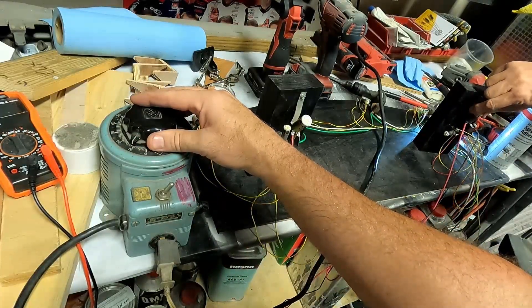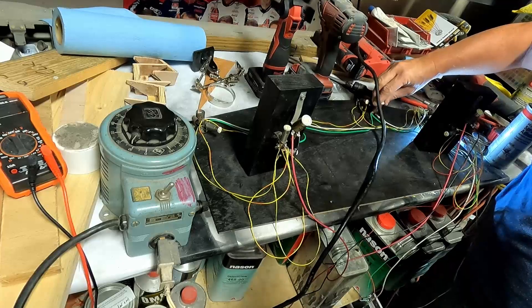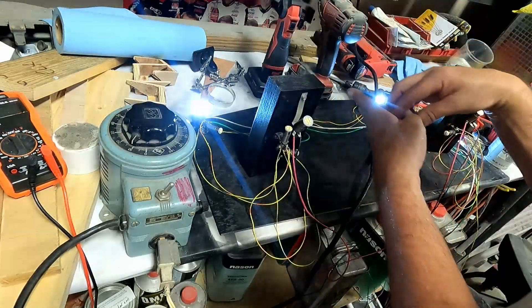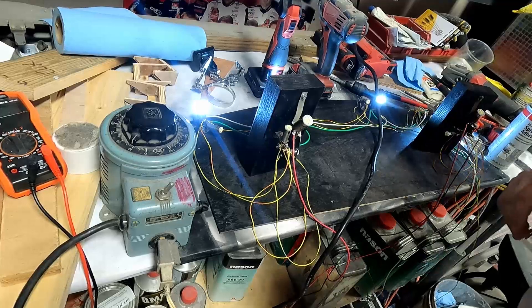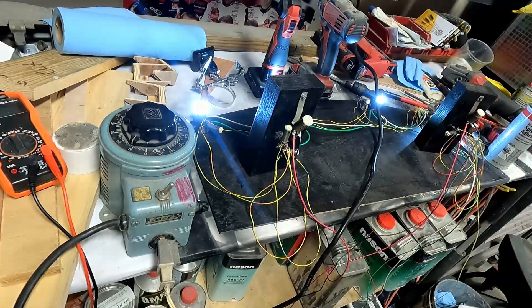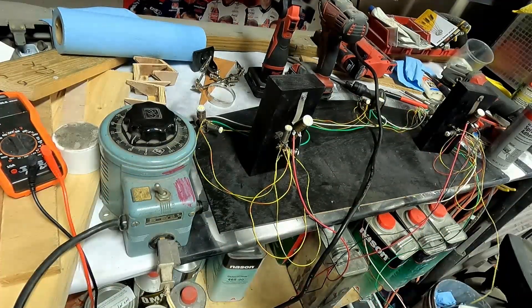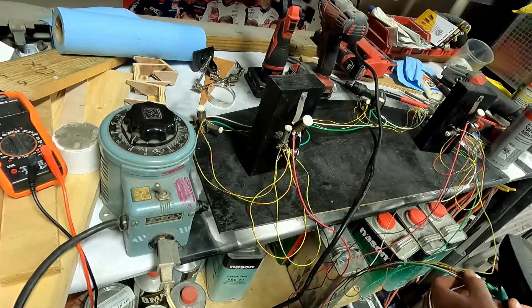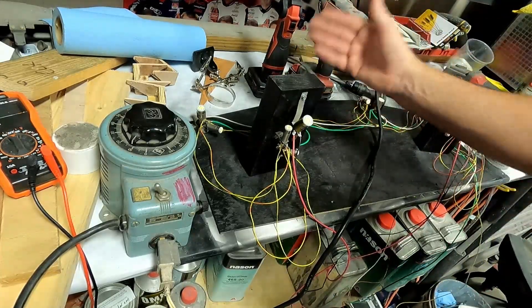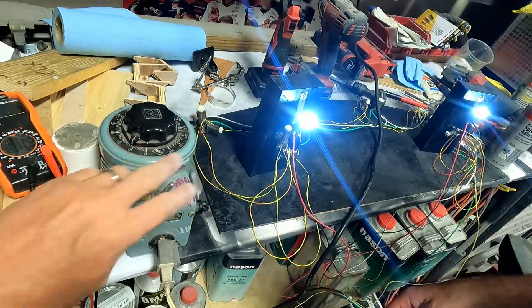That one's on, this one's not — oh, this one's a different flasher, this is the black one. So only that flasher's on. Go ahead and pop in a few more — okay, one more. Those all work! 12 volts — boom, all the flashers are going to flash. The last one to test is the black and the red wire at 12 volts. These are 12-volt flashers too, on a different circuit — two different flashers hooked up, so this will go bang bang bang as the lightning bolts flash in the back. Black and red are done.